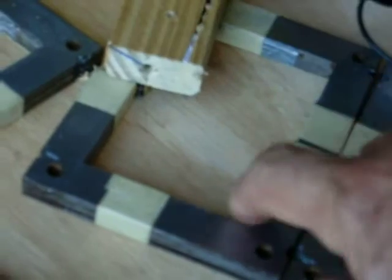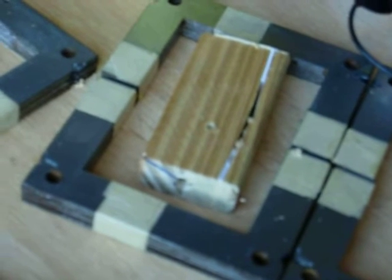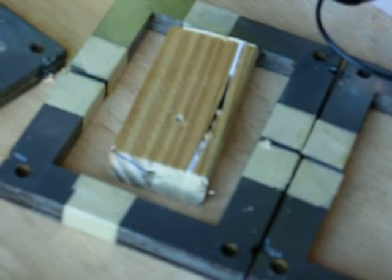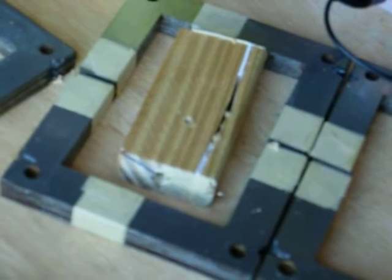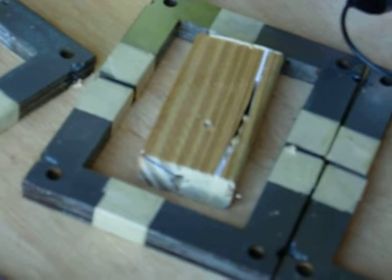Here's the second core — same deal, just different sizes and shapes. I'm doing this whole thing so I can easily take these apart and change what's going on with the coils and the plate. I'm going to use copper and aluminum in different layers and different thicknesses, and vary the wire gauge and turn count. These only have two and a half turns of copper so it's not much, but I want to get a relationship between the amount of metal versus radiation, and find out what's really going on so I can actually design my own house transformer.